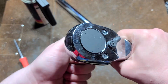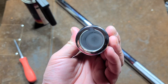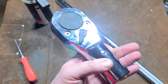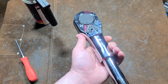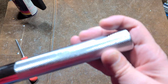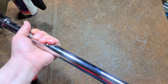I actually kind of like that — it's one of my favorite features of ratchets that do this. The detachable handle means it is easy to remove it and use it as a stubby just to run out fasteners. Gray does not advertise what the torque rating of this is, but I would expect it to at least take a thousand foot-pounds — come on, it's an inch drive; you're not going to be working on laptop computers with it. The last comment is I would like to see a lot more aggressive knurling, since these are going to be used in really dirty environments with a lot of grease, and it'd be nice to have more aggressive knurling so it's less likely to slip.